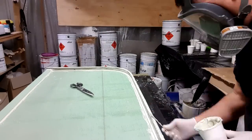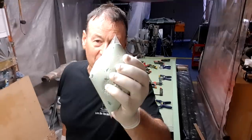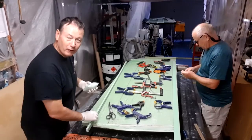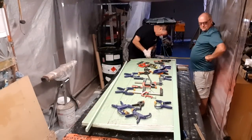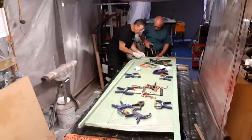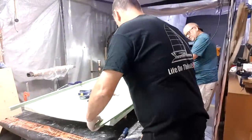We've got the Sea Light catalyzed at two percent, in a piping bag - that's the only way to put this stuff on and get it on reasonably neat. We're going to do all these edges along here and one person will follow up with the clamp. As is always the case in any boat building project, it requires a multitude of clamps. A level of patience is also required whilst working on a job like this as you need to get on with other things while the chemistry takes effect.